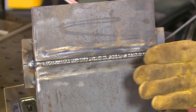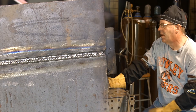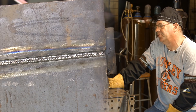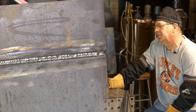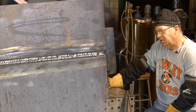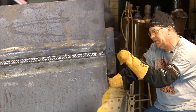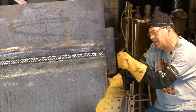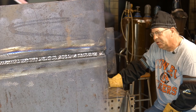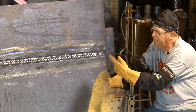From here, we have options on this thickness of plate. You've got the option of running two 3/32" 7018 fill passes, stringer beads stacked in here. You could run one with a little J technique, pause at the top, bring it down. You could leave it in flat and go straight to cap. You could go 1/8" 7018, point your rod up just a little bit — anything you can do to get that out just a little bit more.